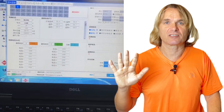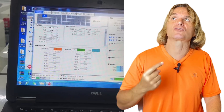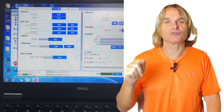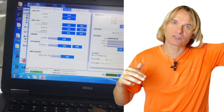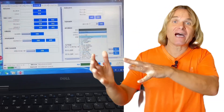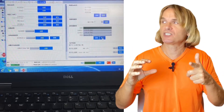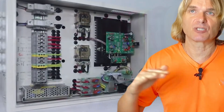For this reason we need a controller between the wind turbine and the inverter. Such a controller costs around $250 — I know because I helped design such controllers for my turbines. It includes the rectifier and handles another important issue: when grid power is cut to your home, your PV system stops working. That's fine for solar panels, but a wind turbine always needs a load. This controller lets you connect any electric heater to it — in Poland we typically connect an electrical heater to the water-based central heating system.